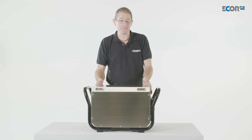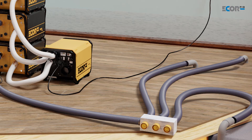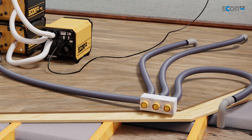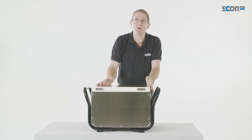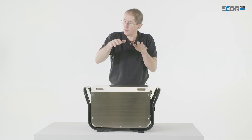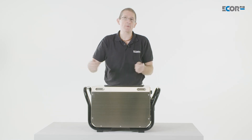We need a powerful machine. It's quite straightforward — we just need to drill holes in the floor. We put our manifold and pipework pushing the air into those holes through the floor. We take the dry air created by the dehumidifier, put it into the turbine. The turbine creates the pressure that's going to drive the air underneath the floor and the desiccated air is then going to remove the moisture from the wet materials.